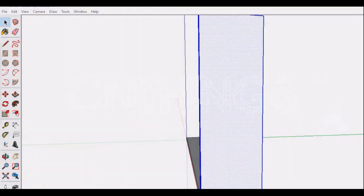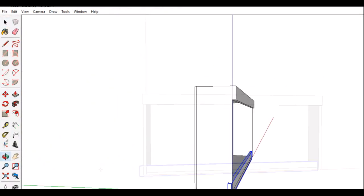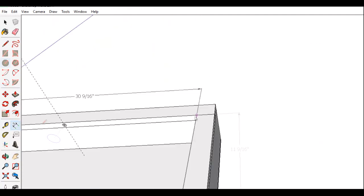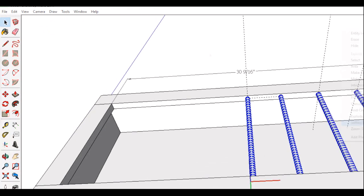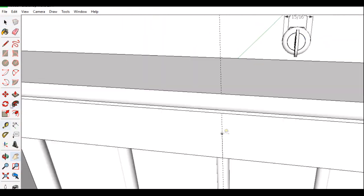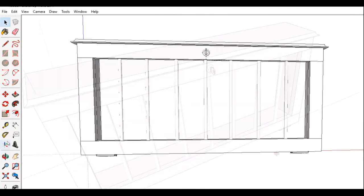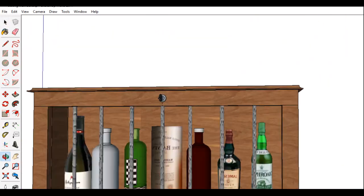The majority of this cabinet is going to be made of three quarter inch pine with an MDF back and a plywood French cleat to hang on the wall. I'm going to create the box first and use it as a reference to make the frame the exact size I need with about a quarter inch overhang on each side except for the top. Pieces of rebar will be cut a little bit undersized and epoxied into the holes drilled into the frame, then I'll add the top with the decorative edge and a cam lock will be mounted in the front of the frame. It'll have hinges on the bottom to attach the frame to the box, then I'll give it a few coats of polyurethane until it's a shade that I'd like. So that's the design process, let's get into the shop and build this thing.